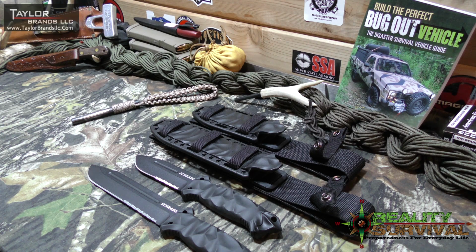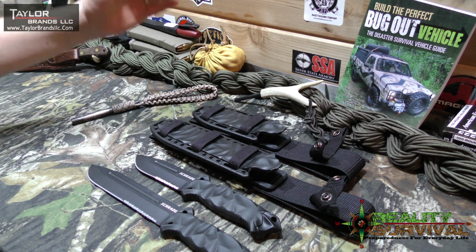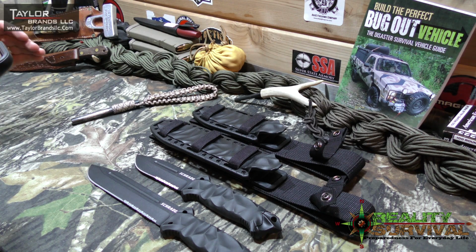I got this from a pocket guide to knives, a lexicon of blade steel, and I'll put the link in the description below. It goes through all the different knife steels, how they're made, and what they're good for. It says 420J2 stainless steel has a little bit more carbon in it than 420J. It's sometimes used in dive knives because of corrosion resistance. It's used in surgical instruments due to the ease of machining and corrosion resistance. With proper heat treating, it can achieve a Rockwell hardness of 56, which makes it comparable to 420HC. It's often used in scissors. It's not a true tool steel, however, because it's used in making certain surgical tools, some people will call it a tool steel when that's not actually the case.